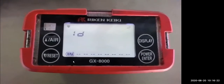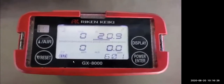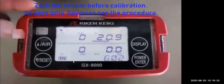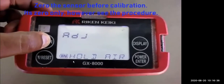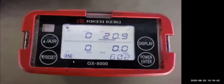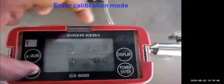Carbon monoxide 25 ppm. So this is the present reading now. LEL is 0, oxygen is 20.9, H2S is 0, and carbon monoxide is 0. Now we do the air calibration. Air calibration will take the air. Again from the air you can see hydrocarbon is 0, oxygen is 21, and other gases.